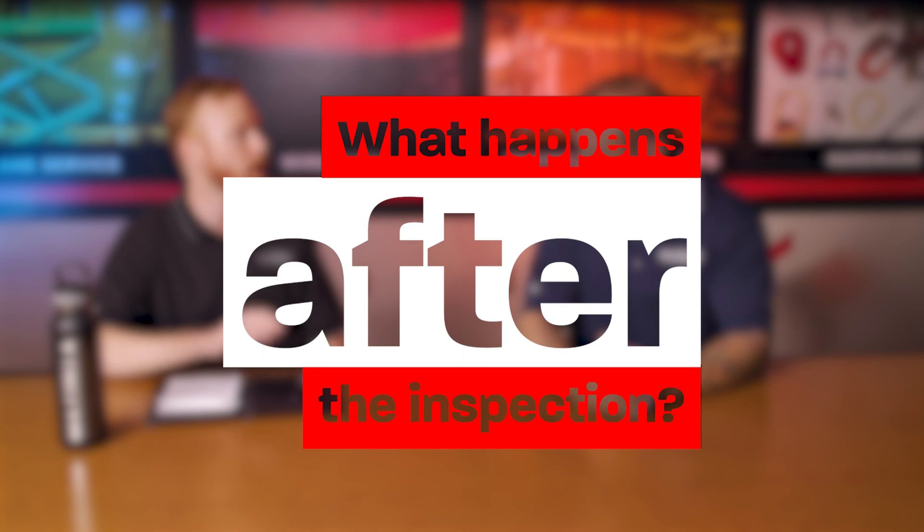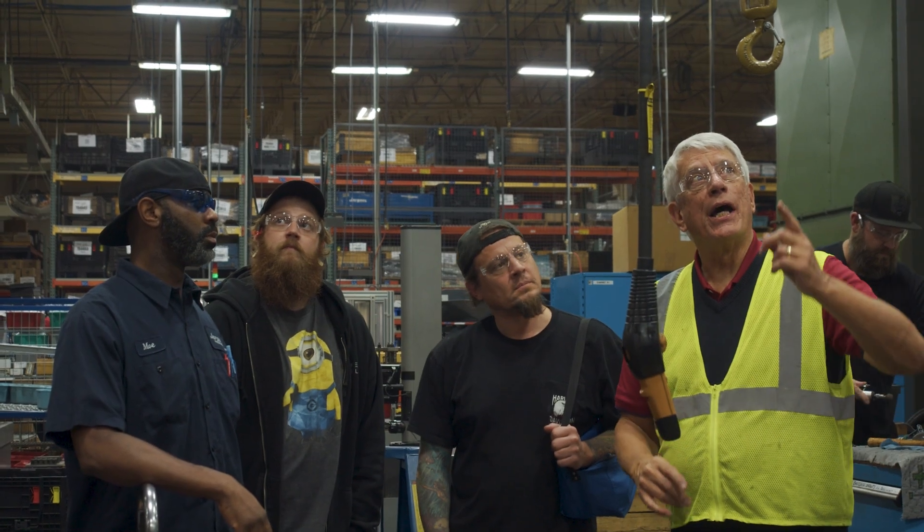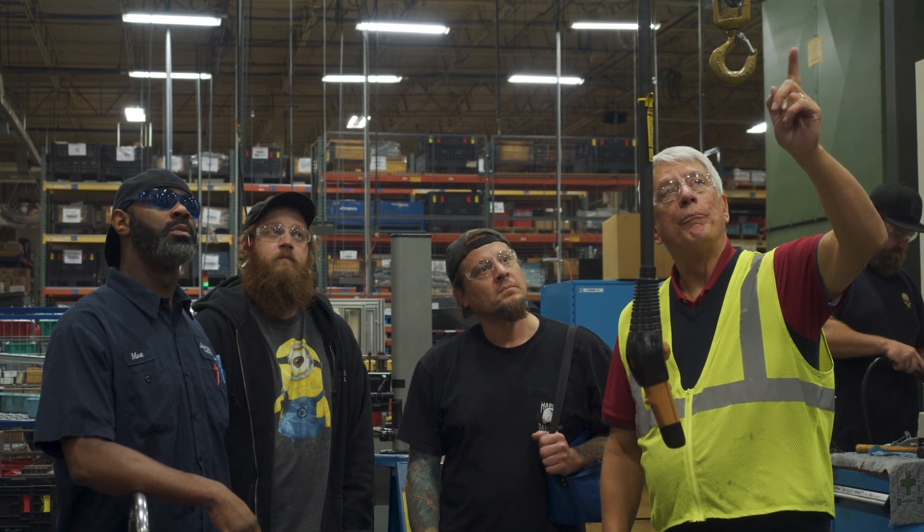So you complete the inspection — you've looked at everything. What happens next? At the end of the inspection, we're going to talk about our findings: here's a pile of slings you have to replace, here's what might be able to be repaired. We can address those conversations. And we'll also give some findings like, hey, we looked at 200 pieces of rigging today and had to discard 100 pieces — I think it's time to look at some additional training. Make sure you have the processes in place so that your users are doing the pre-inspection frequent inspections. We even get some interaction during the inspection with the users — they might ask us questions like, what are you looking for, or how do I know how much this sling can lift? Which the user really has to be able to know based on the ASME standard.